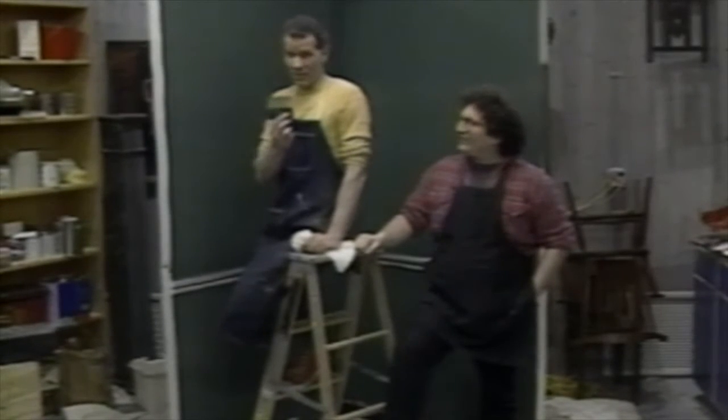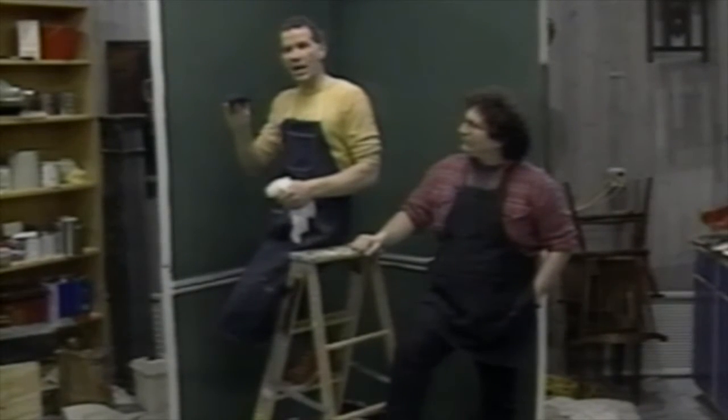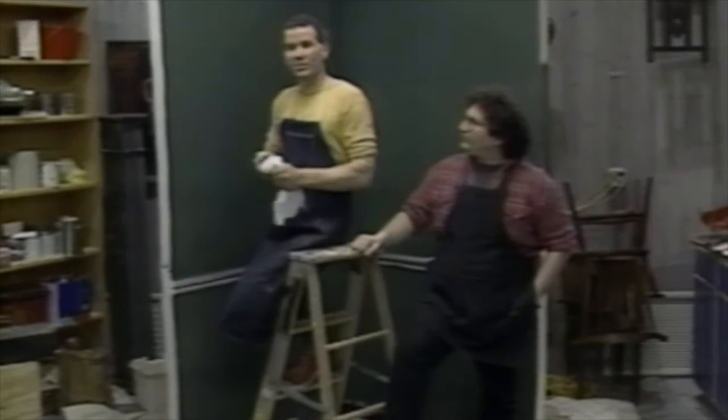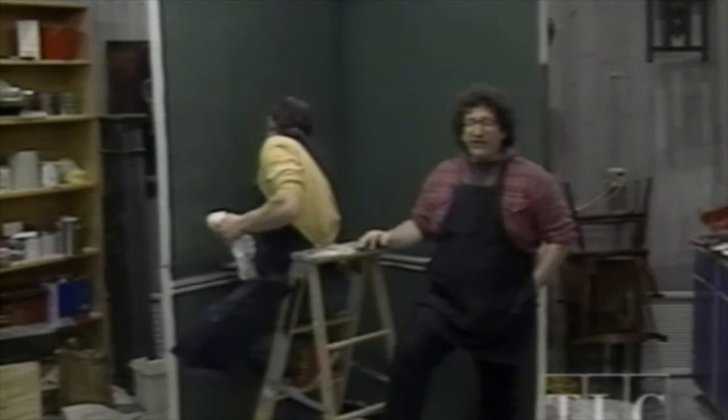I'm ready to grain. I'm going to use this comb and a rag. When I pull down I'm going to gather paint on the teeth, and just wipe it off as you go. The trick is I'm going to pull from the top down, and then go from the bottom up. Now we've painted both walls and let them dry. You have to judge how long to let it dry. If you're doing a whole wall it might be a two-person job — one person uses the roller and the other follows with the comb. If you're doing it by yourself, don't paint ten feet of wall and then go back to the comb, because the beginning will be too dry. Make sure the paint isn't too thick or it will bunch up on the comb.